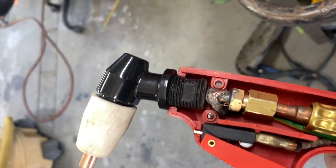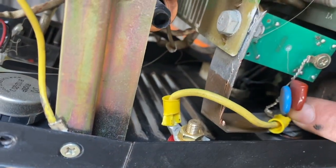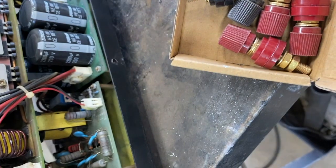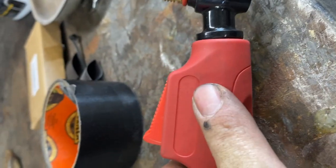I'm going to drill a hole right here and attach the lead to the grounding strap — the same grounding strap where the clamp comes out. I have all the wiring in there; the yellow wire is soldered to the pipe going through to the front. I closed it all up and put one of these lugs on there, connected to the ground. I put a red lug in — it wouldn't matter if you used a black one. I got these from Amazon, about eleven dollars for the whole bunch.